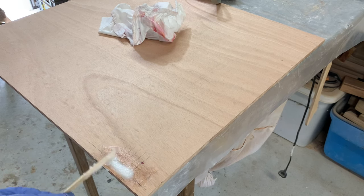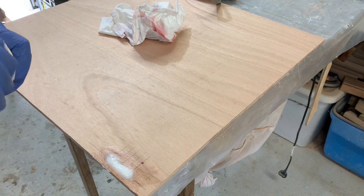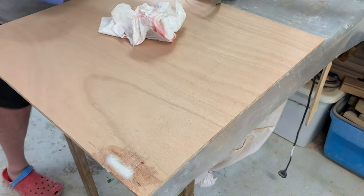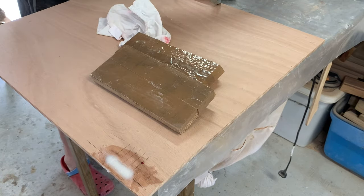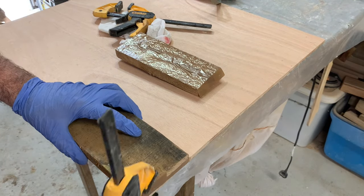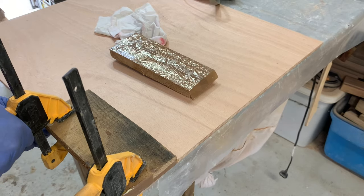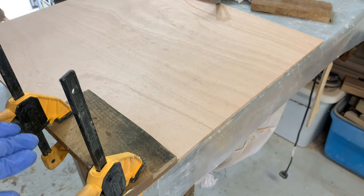Right, so I'm leaving it ever so slightly proud over that line. And what I'm going to do is I've got a pile of these, and we use them for this sort of application a lot of the time. I'm going to put this on the top where the lines are. So that's going to push filled epoxy, the thickened epoxy, rather down into the hole and create nice smooth flat